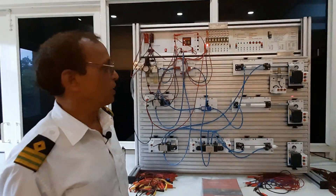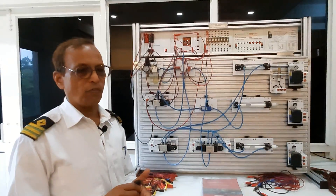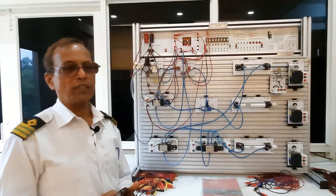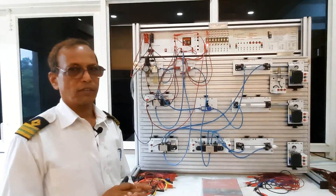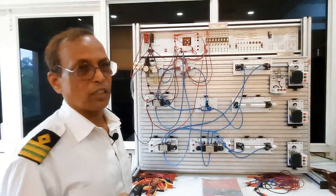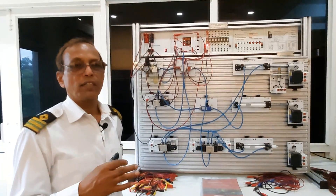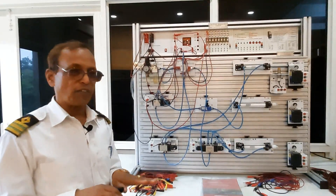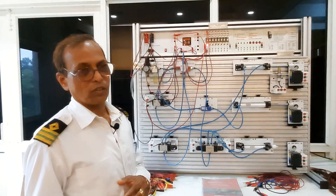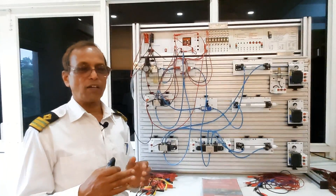When we are filling the IG on the deck and pressure is less, there are two valves: one is the IG filling valve and the other is the atmospheric valve. When putting to the IG filling valve, that valve will open and the atmospheric valve will start closing. When pressure keeps increasing and reaches 50% or 60%, pressure will start to be controlled on the deck. When pressure is controlled, the atmospheric valve will start opening. They work at 45 degrees to each other — so the deck valve is open and the atmosphere valve is closed. When pressure increases on the deck, the atmospheric valve opens more and the deck valve closes slowly.